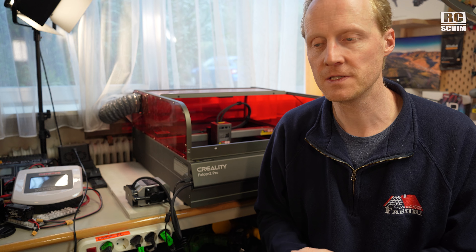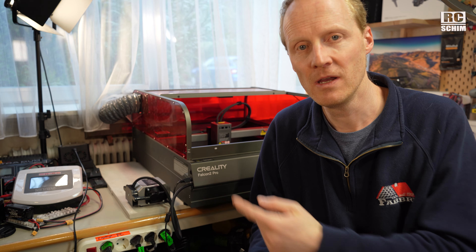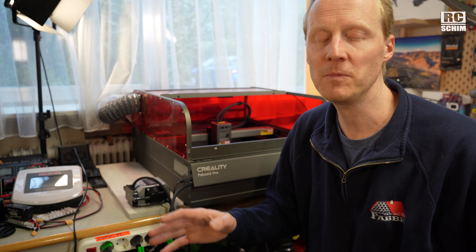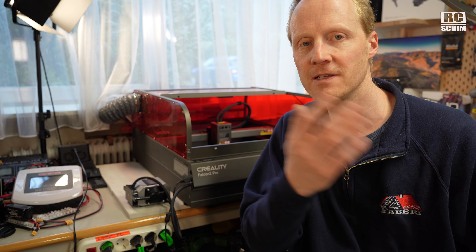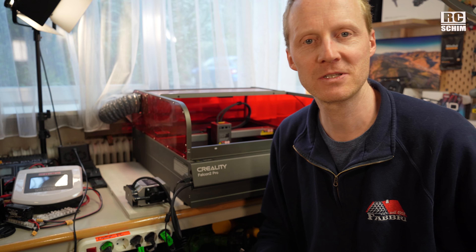Engraving is not always easy, especially it's hard on reflective surfaces like pure metal. There you sometimes have to use spray paint, then you can engrave, and then you wash away the spray paint with acetone and it kind of looks like engraving. The easiest of course is wood — it's soft and non-reflective so it totally works with lasers. I will try a lot of other materials and publish a few shorts to show you the things I've done with the laser cutter in the next few weeks. Make sure to subscribe. Please let me know in the comments how you liked this video, what you think about these products, and if you have a laser cutter yourself, let me know your experience.